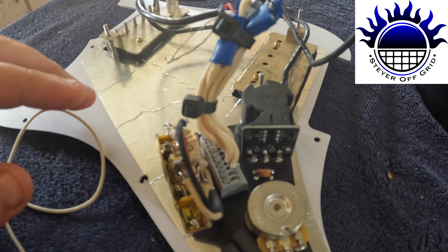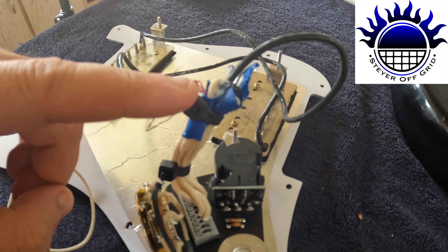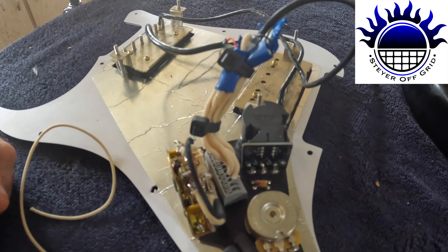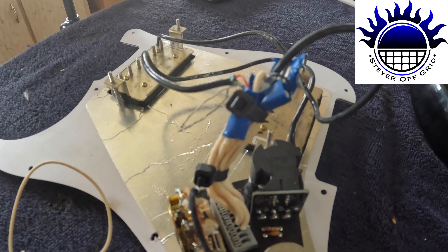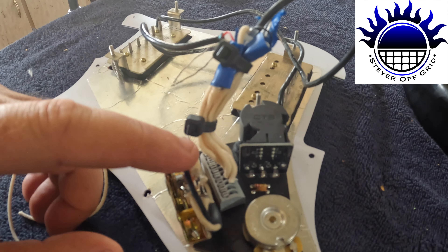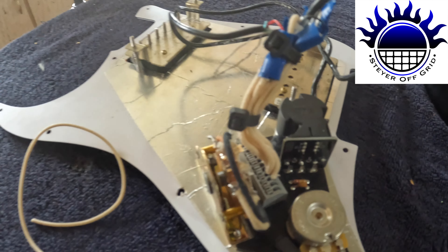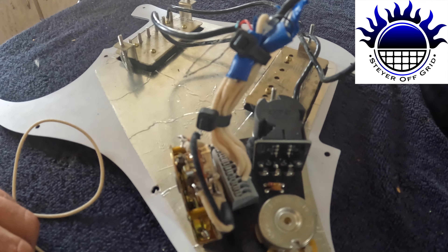Would I buy it again? Probably not if it's got the same terminals - it's just not worth the stuffing around. If I'm going to solder all the connections here, I may as well just solder directly onto the pots. Maybe the guy's got a trick to doing it, but I'm an electrician by trade and I've used a lot of push-in connections - I've never had a problem with them. But this brand? No good. They're small yes, but so hard to use it's unbelievable. You have to be really, really patient to get the wires in there.